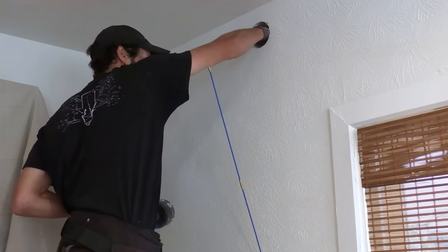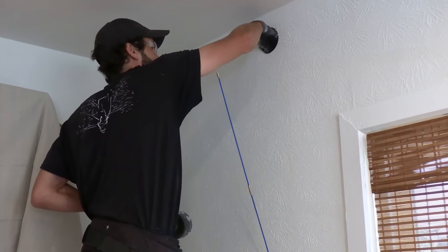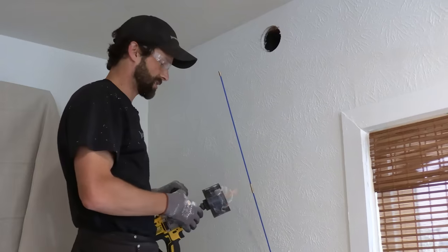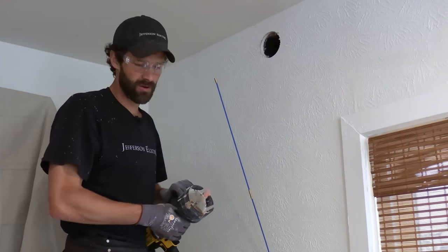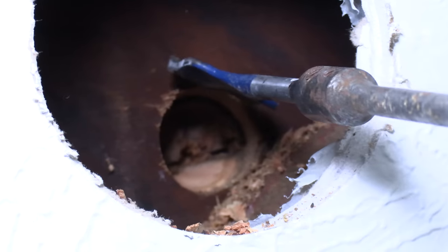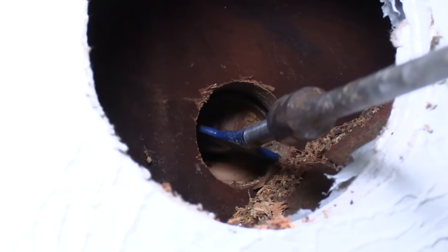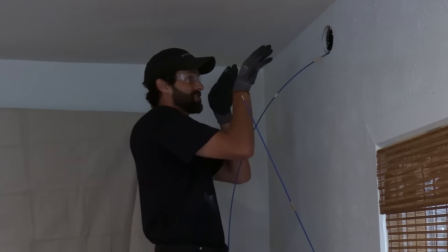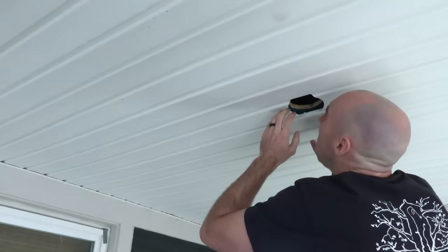That's why we weren't seeing it — there's sheathing right here. I'm going to tuck that insulation out of the way, put an extension on my hole saw, and drill a smaller hole — we don't need this full size. Now I've got my longer bit. Whenever there's more material than expected, stop and check, because what you might be doing is punching out just above the roof line or something goofy. Now my job is to dial that fish stick right in and make it come out of that hole without too much effort.